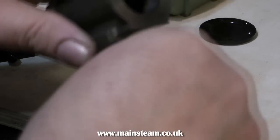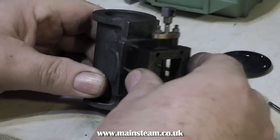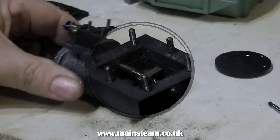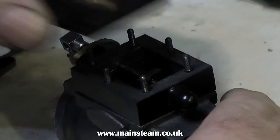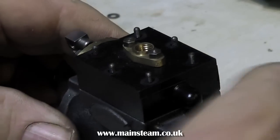I found that when using the plug tap, I managed to get three and a half turns more down into the hole. So the studs are a perfect fit in the holes and they go right to the bottom of the holes as well. Here you see a temporary assembly and everything fits very well indeed — I'm quite pleased with this.